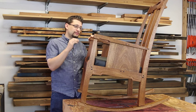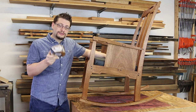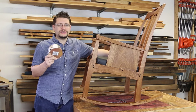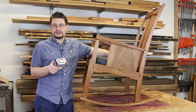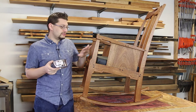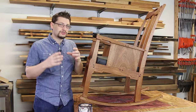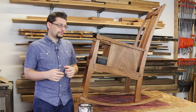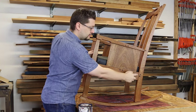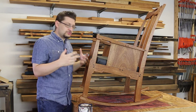After five coats of shellac, it was time to jump over to the Black Bison Tudor Oak Liberon wax. You guys have seen me use this before — this comes from Christopher Schwartz's recipe for an easy mahogany finish, and I really love what it does. First of all, it tints the wood, which is great. It adds wax that gets into the pores and all the little nooks and crannies on the chair. What's great about that is it helps immediately age the chair. I love the little bit of buildup of the wax on the joints — it makes it look older immediately.